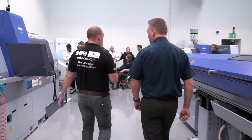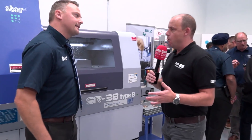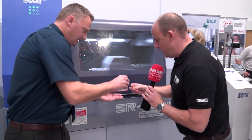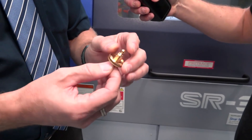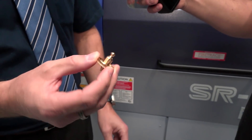We then have here another 38mm machine — this is the SR38 Type B. This machine's got a full live B-axis, it can go up to 42 millimetre bar without the guide bush, and you can go through the sub spindle in that size as well, with a lot of tools. You've got some lovely features on here: engraving, gear cutting, and some nice angled hole features — all done in one hit.